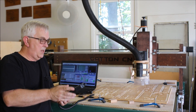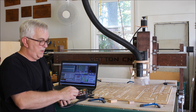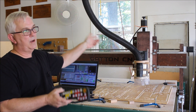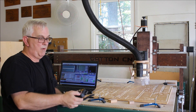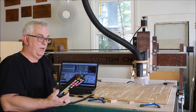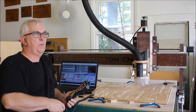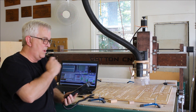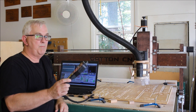In my case I can't use the spindle on/off or spindle speed buttons because my router isn't wired into Mach 3 — I just flip it on and off manually. If it were set up with a relay through Mach 3 those buttons would work, but that's not a big deal for me. I'll probably look for another pendant and spend a bit more — some I was looking at ranged from $80 to over $100 and had a dial on them. Before I buy another one I'll make sure it has a way to reference all home from the pendant, because that's what I mainly wanted.